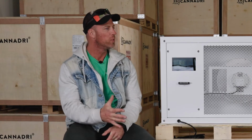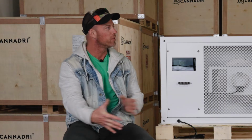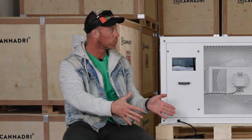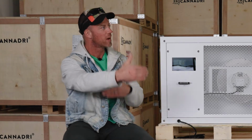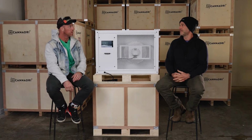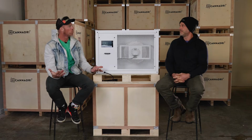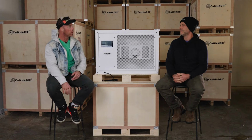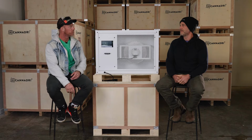Yeah, there's other challenges with desiccant too, right? You have to have it in and out. You need to temper the air that's coming into the space. Yeah. So the air that's coming in, you have to obviously temper or cool it, right? To make sure that you have the reactive chemical reaction that takes the desiccant to make it happen. So it's one of those things. You went that way for a bit. We saw some people, almost a wave of people going to dry rooms using desiccant, and now it's kind of gone away, especially now that you've got low temperature dehumidifiers like ours on the market that can actually get down